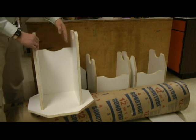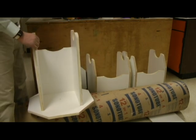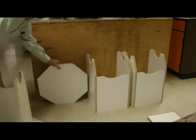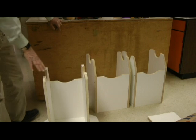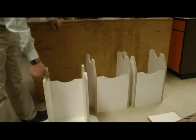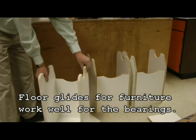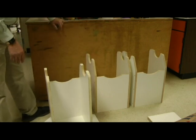You've got to take into consideration the 10-inch tube that goes through here. We'll suspend it with some plastic parts from the plumbing supply store — they'll be the bearings that run the telescope. The base will pivot on that octagonal square. We'll put a bolt through it and a bearing. Our bearings are just a plastic piece with a peg in them — small brad nail, you hammer them in and they'll glide. Down through the center, we'll run a half-inch bolt so it'll swivel and rotate the base on the other base. Then we'll put three feet underneath so it can level itself on uneven surfaces.